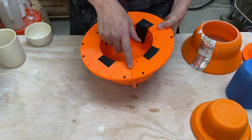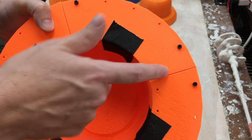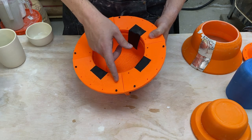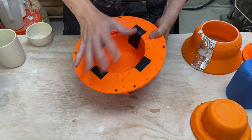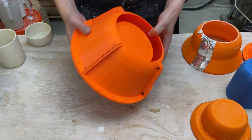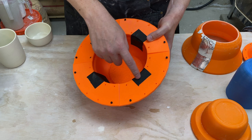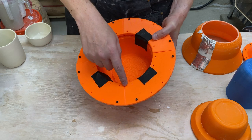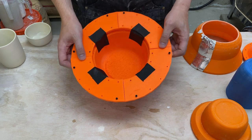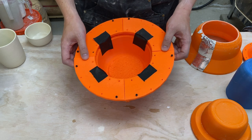One thing I do want to note is that 3D printed pieces are not perfect. This ring here I will need to super glue together to turn into one piece and there's actually a little bit of a gap in the middle - the ends are actually bulged out a little bit. That's not uncommon with 3D printed pieces. I'm going to need to sand these a little bit but we have to be careful about assuming the 3D print is perfect. This was the first version of the software that seemed to work although there are a few bugs. I managed to get the flange calculation wrong so the space for the foam gasket around the inside ring is incorrect. I also managed to get the number of holes wrong - somehow I have 10 holes in the ring and 11 in the inside mold so the bolts on the inside don't work out. I don't really want to reprint this. I think it will work good enough so I'm just going to hack it together and fix the bugs in the software for our next attempt.